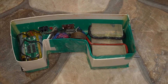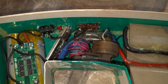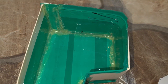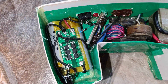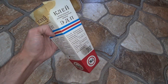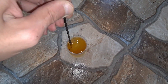It was decided not to fuss too much with the casing and to encase the entire construction in epoxy resin. In the end we'll get a robust, dust-, moisture-, and shock-resistant unit — however, it's disposable; if something breaks, the shocker will go in the trash. To start, I cut out templates from cardboard, taped them, and made a mold for casting. All gaps were first sealed with hot glue, and on top of it glue B-7000 or something similar. All switches, buttons, the power LED, and the charging port need to be thoroughly filled — otherwise resin will get inside and all the work will be for nothing. After placing the components in the mold, we take the epoxy — in my case it's Dzerzhinsk resin — and prepare a mixture of 10 parts resin to one part hardener. Let the mixture sit for about half an hour, then pour it into the mold. The resin should not be heated for quick hardening so that all air bubbles have time to escape.